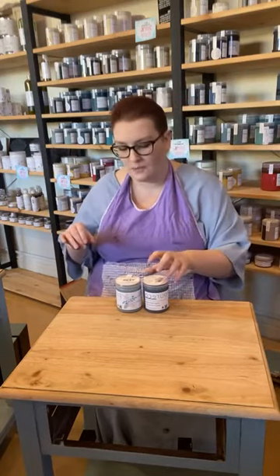For these edge bits, there's still a little bit of old stain left in there. I always get asked what's the best way to get it out. You can try stripping it, but often the easiest way is to fold over a piece of sandpaper — fold it around like a paddle pop stick and just rub it along that joint, and it will come out. On the little lips and edges, you'll often find the stain's quite thick because it sinks into those bits. I don't mind a little bit of darkness around it, so I'm not always particular about getting every bit out.